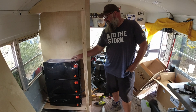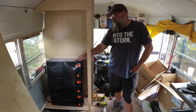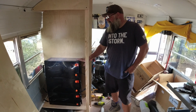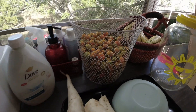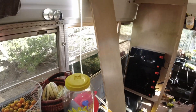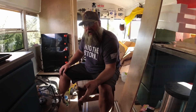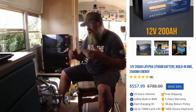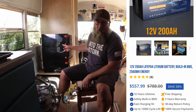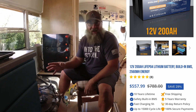The model on these is the LFP12200 — that stands for lithium iron phosphate, 12 volt, 200 amp hour. Now, going over the specs from their website: these are 200 amp hour batteries and they claim to have high temperature and low temperature cutoffs for both charging and discharging. If that's true, this is an extremely affordable battery for its size and features.